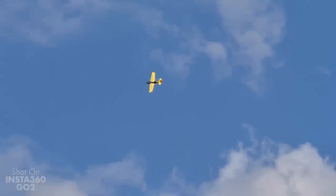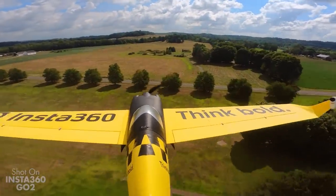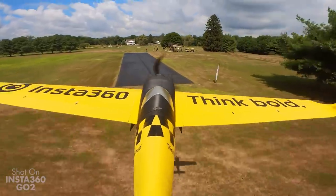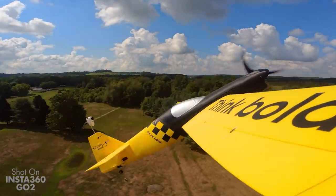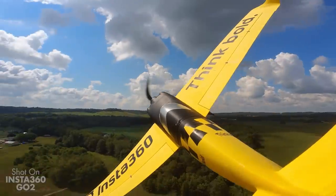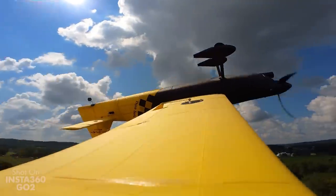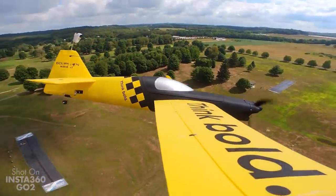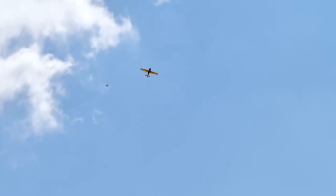We're in the air — not a click of trim. That's awesome! Stephen, there's a big reason why the MSXR V2 is a V2. One of the big things is they completely redesigned the internal structure to make it easier to print and build, which is pretty amazing given how many parts and pieces there are. Eclipson is always evolving their build and printing techniques. One thing I really liked is they moved the servos back — you have very solid linkage controls because now you don't have 20-plus-inch long pushrods. You simply have a servo in the back, a very direct linkage, and that is critical when flying an aerobatic airplane, especially a fast one. Roll onto inverted — on rails! Inverted is stable as a rock with a little bit of forward pressure. No gyro stabilization in this, by the way — 100% throws, 30% expo. We're flying the airplane true.